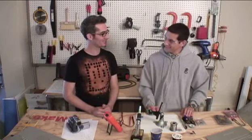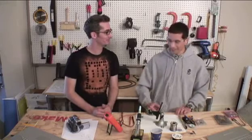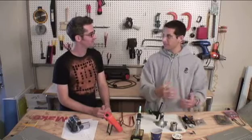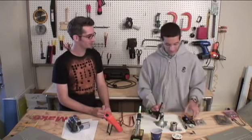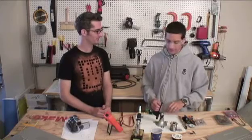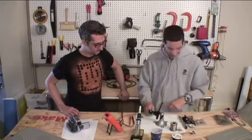You don't really want to breathe solder fumes. I did it for about 20 years before I ended up buying a portable solder fume extractor. There's lead and other materials you don't want to breathe in. So if you don't have a fan or some sort of extractor, just hold your breath while you're soldering.